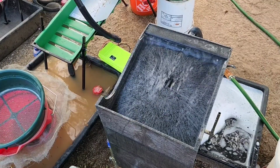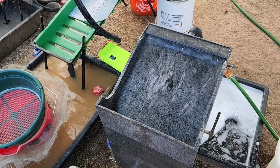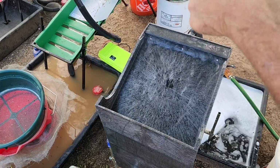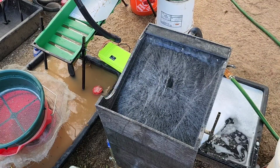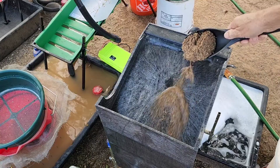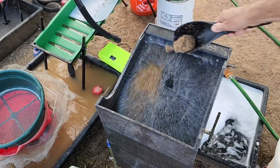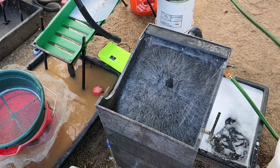Okay, bring you back. We got the gold cube fired up. Four-stage gold cube. We're going to run the tailings that we just got out of the new Geo Banker, and we've got the screen down to 1/8 inch minus. We're going to run it through the gold cube, see what, if anything, we lost.